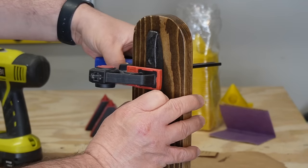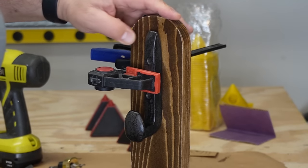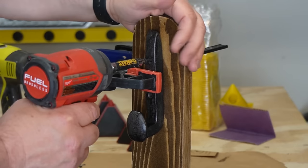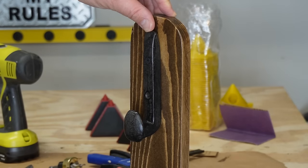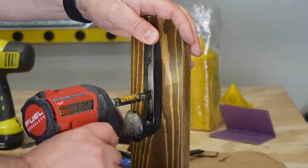I got these hooks from Amazon — I'll put a link in the description. They're about 20 bucks. You can find different hooks if you want something cheaper, but I really like the way these look like railroad spikes. I put them three-quarters of an inch from the top, then pre-drilled and screwed the top hole, leveled the bottom, and then pre-drilled and screwed the bottom hole.